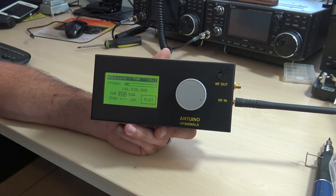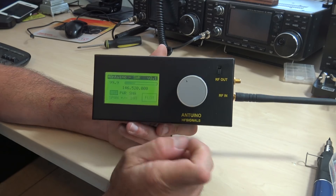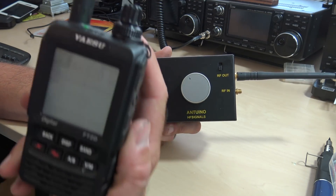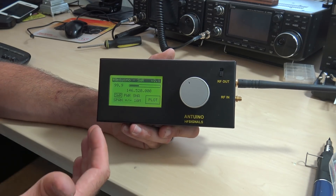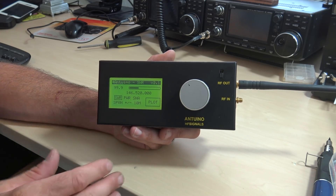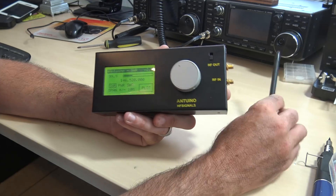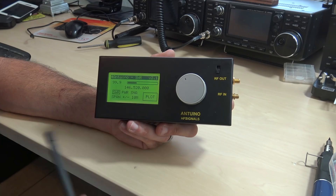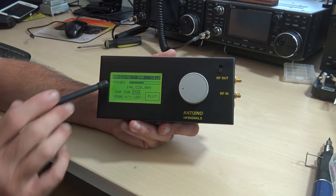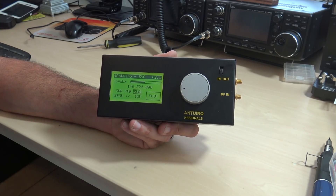Let's use it as a signal generator, which produces square waves. We'll go back to SWR mode but change the antenna to RF out. Right now at 146.52 — I'm transmitting and it's being received on this radio. You could use this as a signal source, whether you put it through a circuit and measure it on the RF in, or just use it as a general signal generator. I could also use this for coax loss or velocity factor — RF out to RF in — and setting this to SNA mode. I can see the loss factor of my coax: it sends the signal out, measures it on the end, and I can see my loss factor. So if you have a hundred-foot piece of cable and want to see the loss in that hundred feet, you can do it that way.